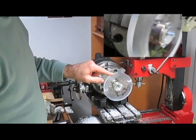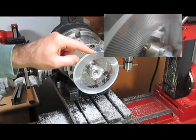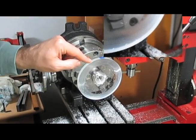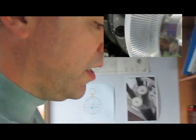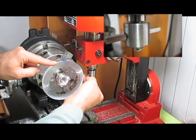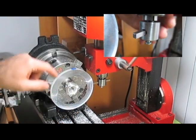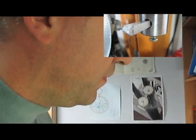The one I'm doing here right now on the machine has 650 waves and 300 waves for pumping action. Those are quite different because they are diamond shape, and those are just sine waves. I'm just using a fly cutter which I made myself, which is a 90-degree angle.